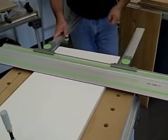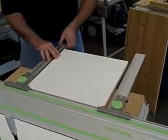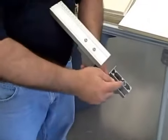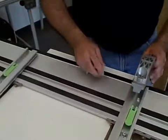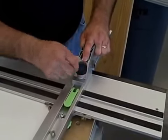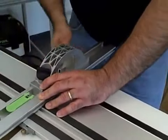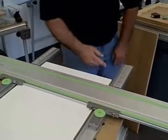That's if I want to cut all the way to 26 inches wide. But what if I'm doing thin strips — less than seven and a half? Then we have these. These are the extensions. Just like this — got a little scale right here, got a hole here, got a knob. So when I line those up, you always have to make sure the scale is on the inside. You just register it like this, it's simple. Spin it on like that. Grab another one, slide it on just like this. So then I can take that and cut thin strips.